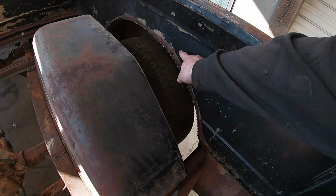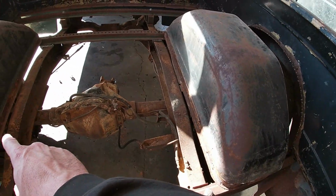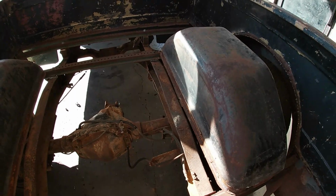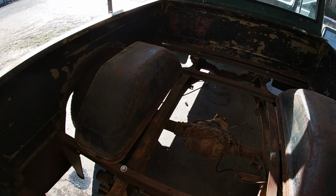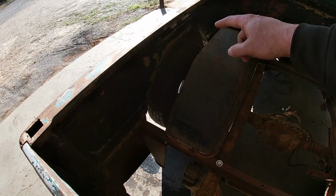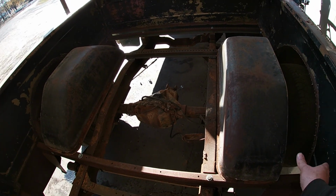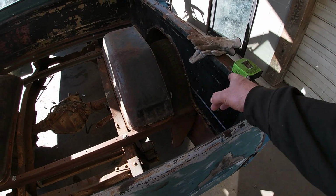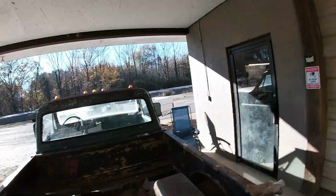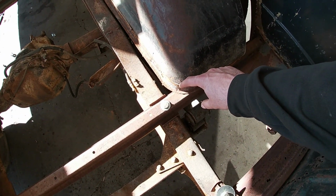And I think what I'm going to do is take some braces and mount them here, so the top of this is mounted. I'll mount my braces here, so these are mounted permanent, connected together basically, so they're permanent where they're going to be. And like I said, I'll put at least 2, if not 4 braces along there where I'm going to have to skin it, and weld them to here, weld them to the side, weld this down here, and that should make those pretty solid in place where they're going to go. And at that point I can come back in and I'll cut this off.